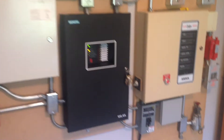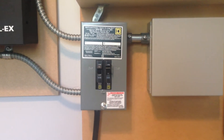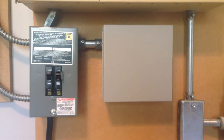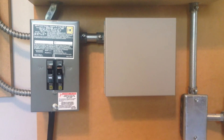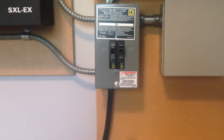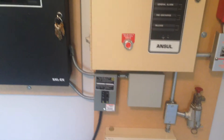The changes mostly revolve around the AC wiring down here. I added this little Square D QO2 breaker box and a DMP322 transformer. Now all the panels are tied together on the one power feed, and the DMP panel no longer has the little plug-in transformer to power it.